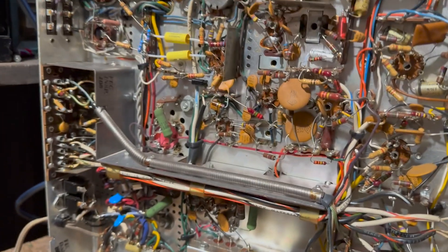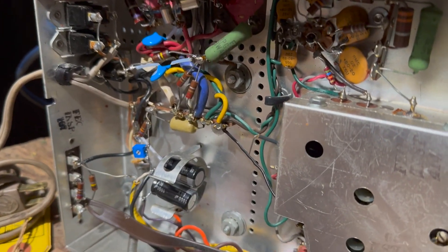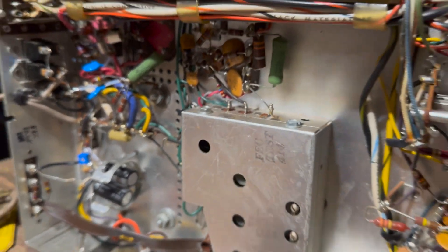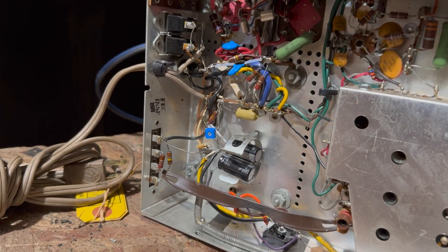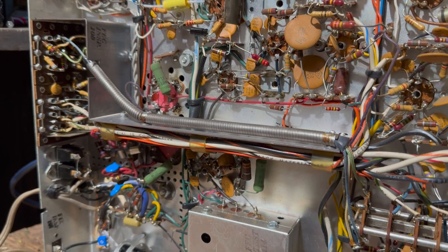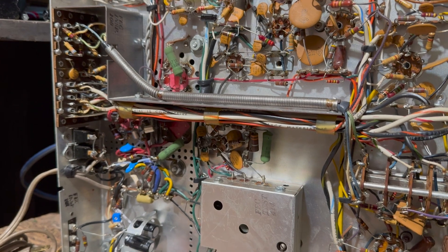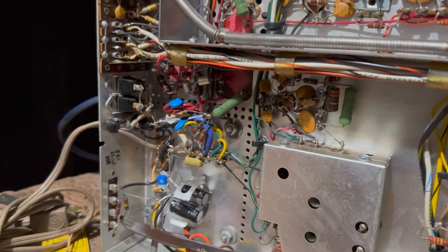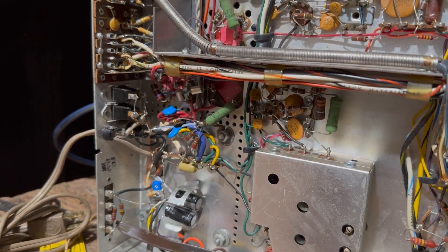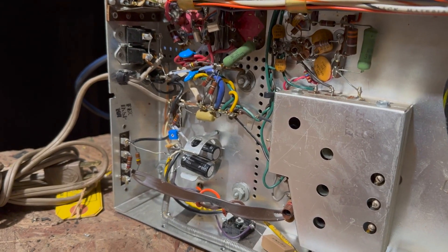When I bring this up, I don't want it to completely destroy the tubes, so I set that pretty low — it's at 2.9 right now. I need to go up or down, I'm not really sure, so we'll find out. I'm basically ready to power up. I have the speakers and an antenna connected. I'll hook my meter up to the bias voltage and see where we're at. If I'm not seeing enough bias, I will right away just shut it down.